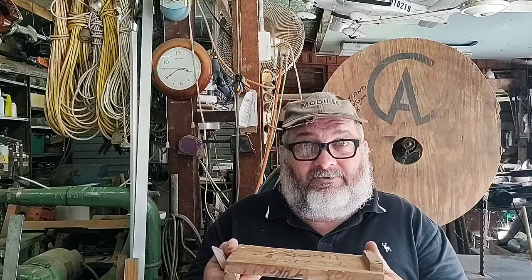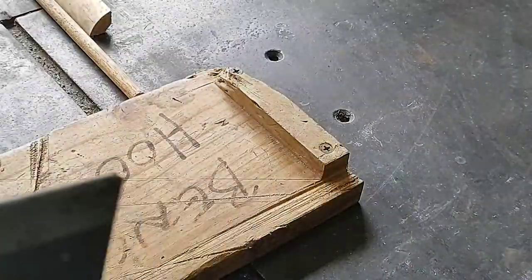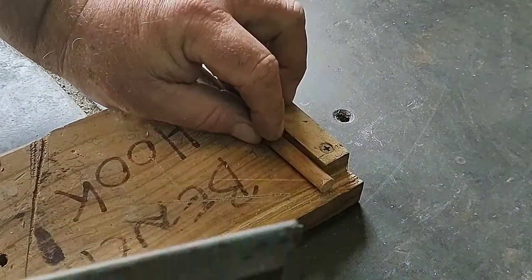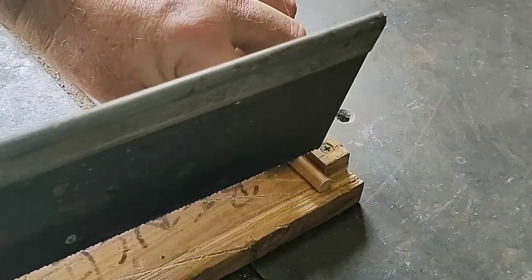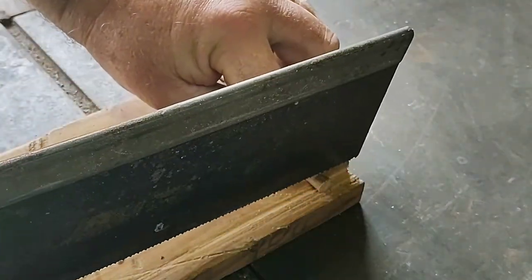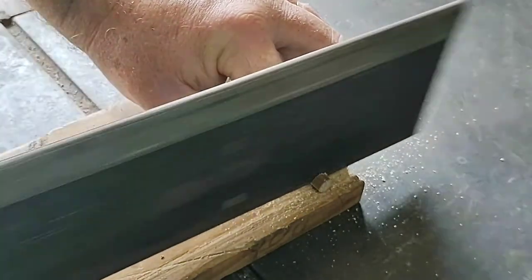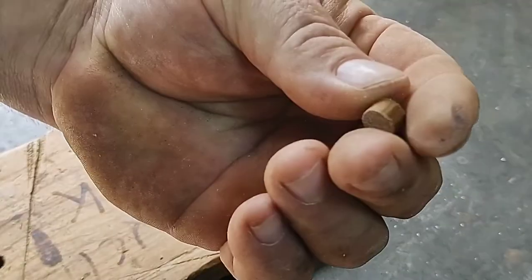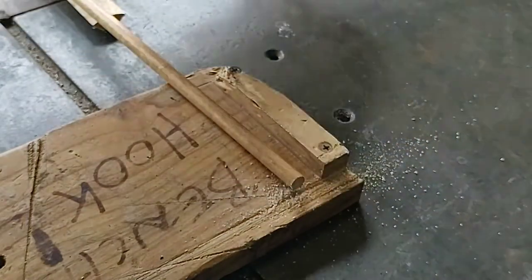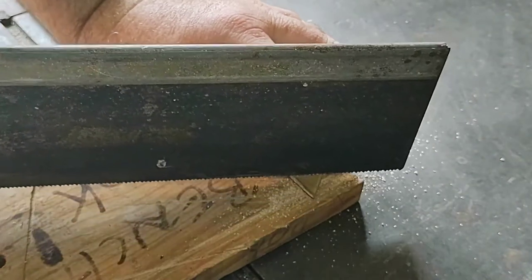Alright, let's get to it. Firstly I'm going to show you how it's used so you can see how handy it is. Here's a piece of dowel — all you have to do is hook this on a bench. Put your finger up against it and cut to your mark. I just use a tenon saw most of the time. There you go — the piece didn't go flying off. Look at how small and intricate that piece was. Maybe you want to do another mitre — you can do another mitre just like that.